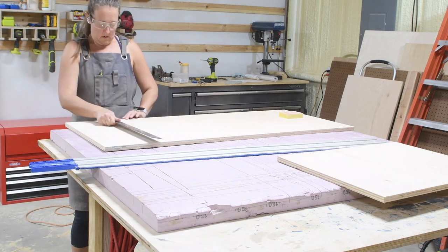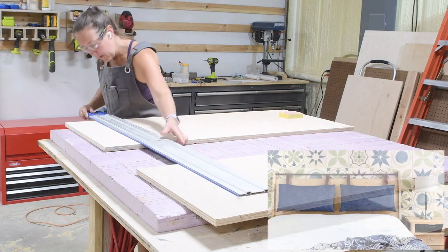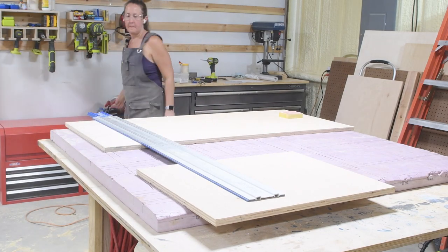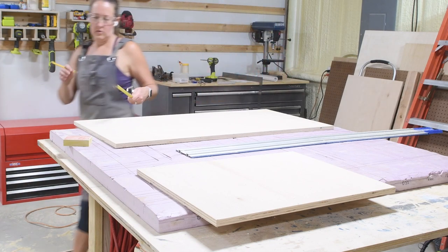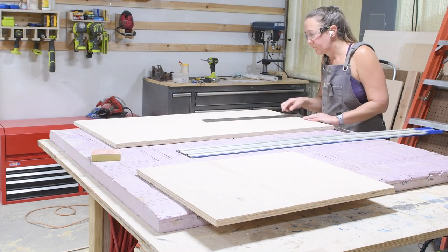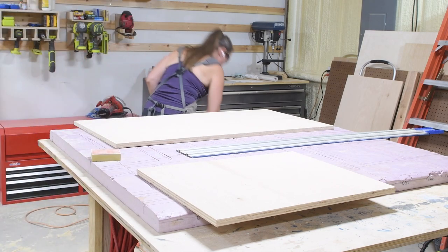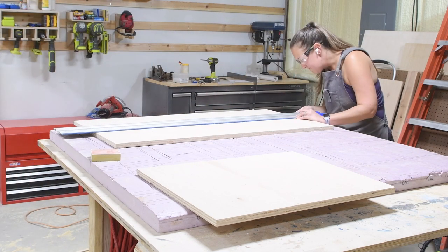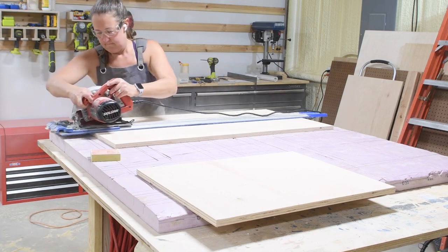The plans call for a half sheet of plywood, and you can get all the cuts off that. However, I'm using scraps left over from a headboard build I just finished — I have exactly the plywood I need for the coffee table, making it a great two-for-one project. I'm going to do my cross cuts first based on measurements taken from the actual build — mine are just a sixteenth of an inch bigger than the 45 inches called for. Then I'll rip them lengthwise for the bottom and two sides, and the last little scrap will become the tabletop piece. All specific measurements are at kregtool.com.